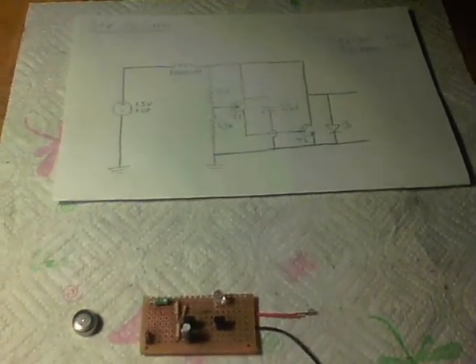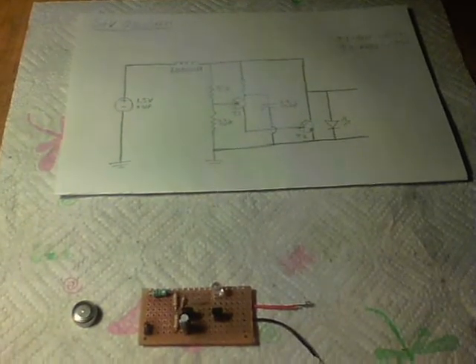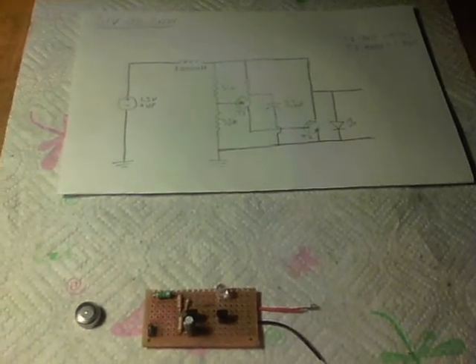This is the strange and versatile oscillator as shown by backup CPU yesterday — and you're quite right, backup CPU, I have made a video. Here's the circuit diagram. It works from 1.5 volts upwards and you just need one inductor — in my case I've got a 1000 uH — and it uses a PNP and an NPN transistor.